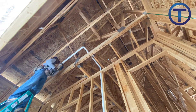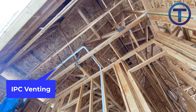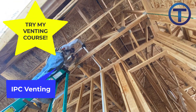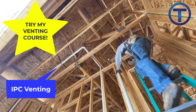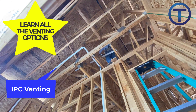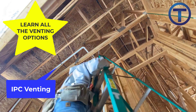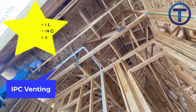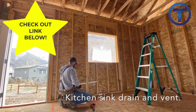I live and work in Utah — we are on the International Plumbing Code, so the venting systems I'm installing are based on that code. It gives a little more flexibility than requiring an individual vent for every fixture. Sometimes I use individual vents, sometimes wet vents. Whenever you're installing vents, you want to make sure you know the code for whatever jurisdiction you're in, as that is determined by state.